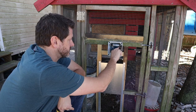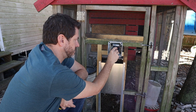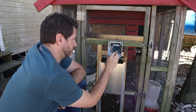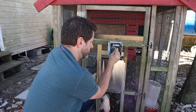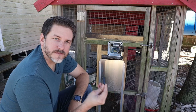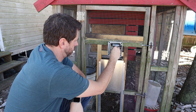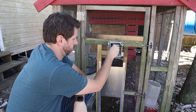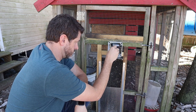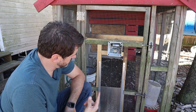This last one tells you what the lightness is right now — right now light is 23. The sensor is right here, and so if you use just a Sharpie cap and put it over that, it should detect that it's dark and close if all goes well. It shows the light is 17, so that's why it's not closing — this isn't dark enough. Let me get a black cap and see if that works. There you go — you can see the door just shuts. I was holding that sensor, that's why it unwound a little bit. Once I pull the cap off, it should wind back up and lift the door.